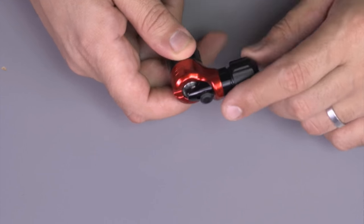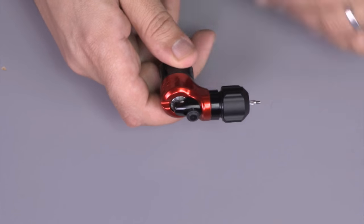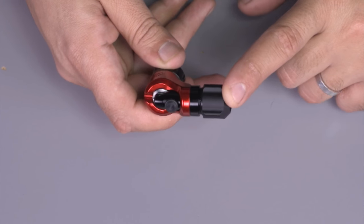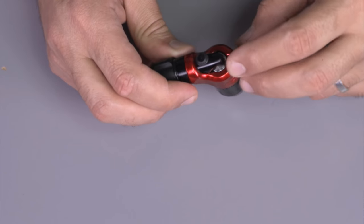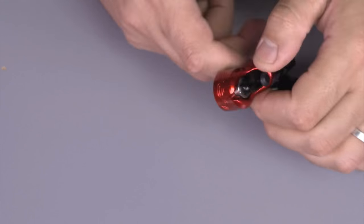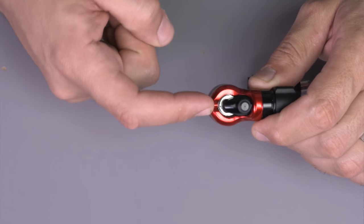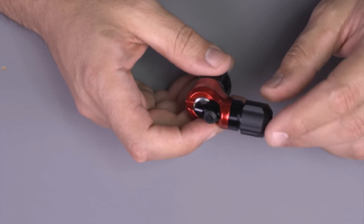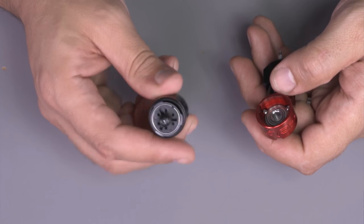We've now populated the collet vice system throughout all of our machines. Another thing that makes this machine unique is that it was the very first machine with adjustable give on the fly — by simply dialing this knob you can alter the amount of give on the push rod. This machine also has a built-in adjustable stroke mechanism: you insert an Allen key here, displace the eccentric, and obtain from 2.8 up to 4.25 millimeters of stroke displacement.